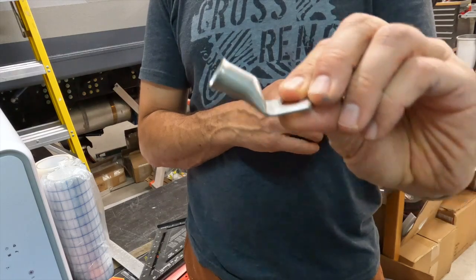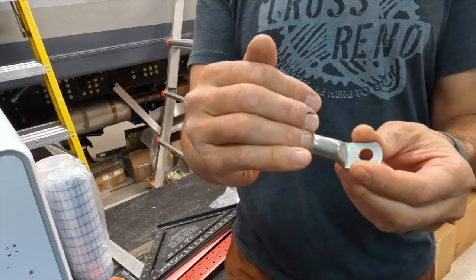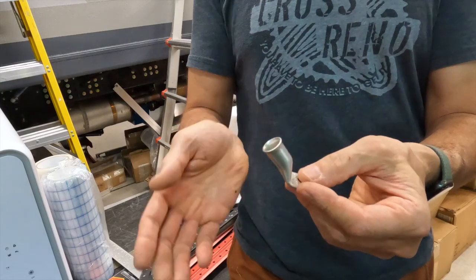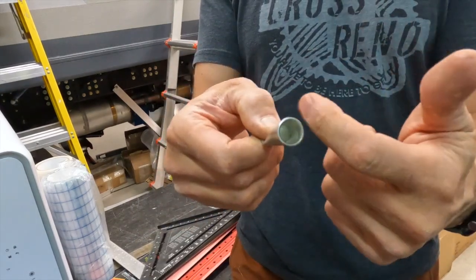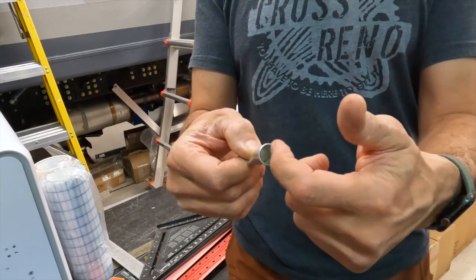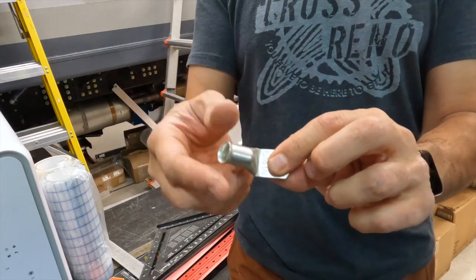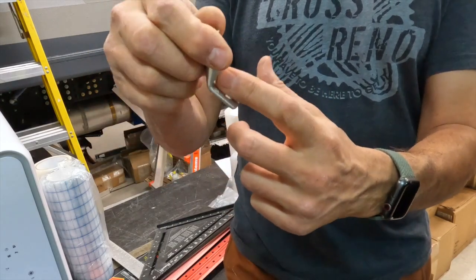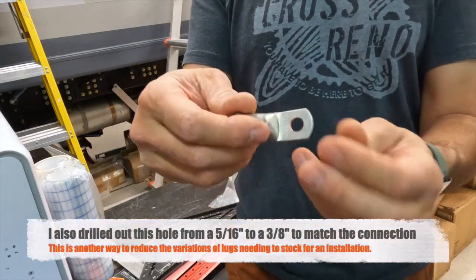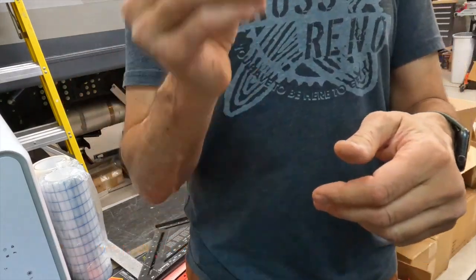I've already put in about a 45-degree angle. I can measure the angle I need, but I'm going to fit this up against there and test the wire as it comes in. I think I need to bend it up probably another 15 degrees. You can see there's no deformation of the wire entry space because I'm gently pulling with the threaded rod, which is almost the same diameter — the load is spread widely. The metal is soft, I've got it clamped well, and it moves easily. The flat surface area of the lug remains completely flat.